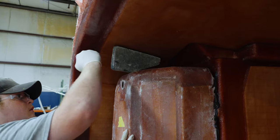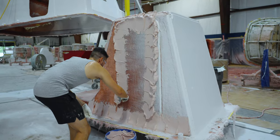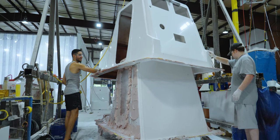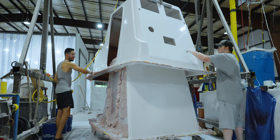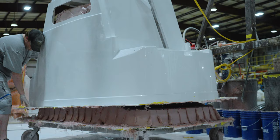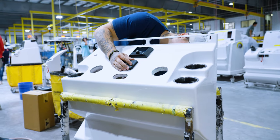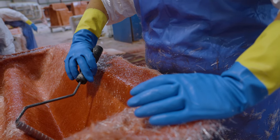One special treatment unique to consoles is that many of them have a glossy gel-coated interior. Due to limitations of open molding techniques, the interior would always have a raw fiberglass finish. To achieve a finished look, a complete second inner part is built that fits inside of the console — this is called a console liner — and will be glued onto the outer exterior. For our larger consoles, there is one more piece called the console pod, an additional piece glued onto the front face that serves as the mounting spot for our ergonomic helms, electrical components, and also serves as a footrest and storage.